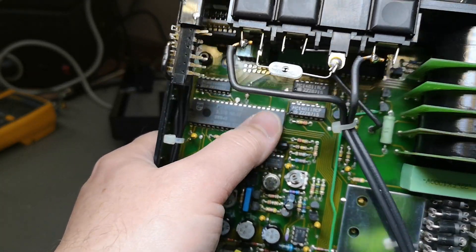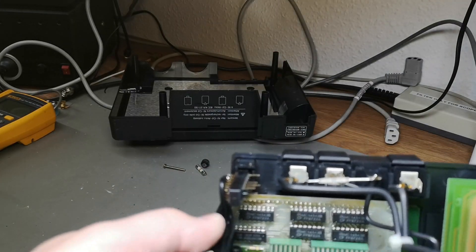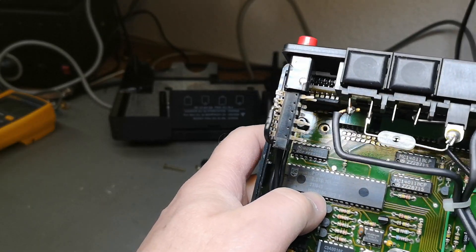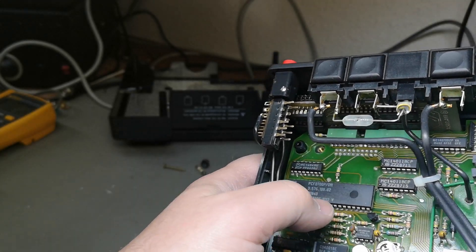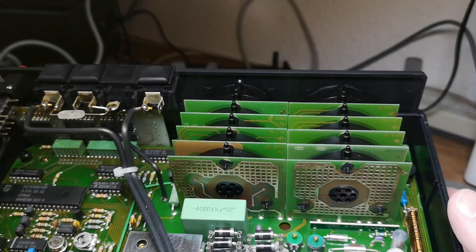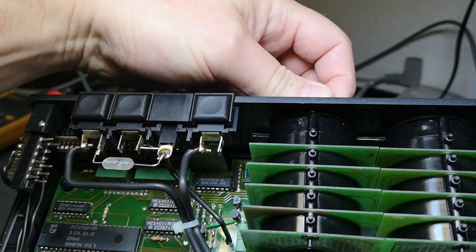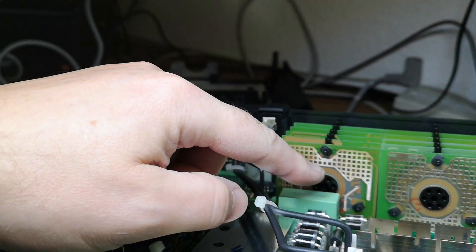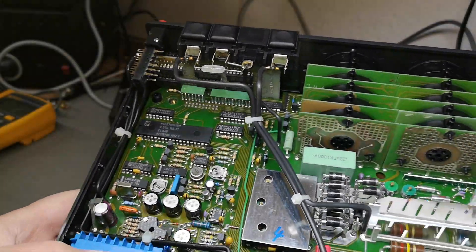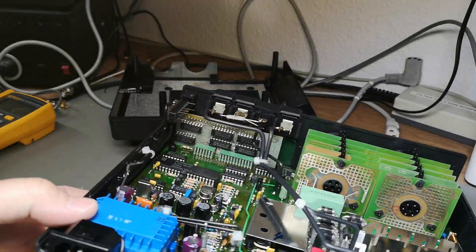I guess this will be the LCD — yes, this is the LCD. But why would we have all those ICs up there with the LCD? Okay — this is the microcontroller that is handling everything, and those are just readout chips. Look at this — I think that is fantastic: they made all the different switches on double-sided PCBs. That is not the cheapest way to do things — this design is quite expensive. I can't wait to power it up.